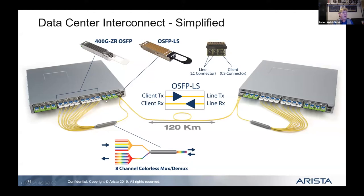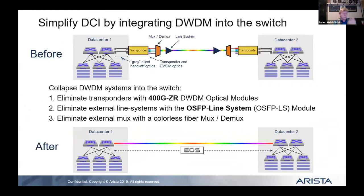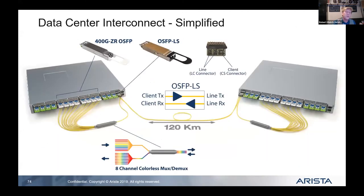Think about it: four times eight equals 32 — that's 3.2 terabits that can go across a single pair of fiber long haul. So if you have a multi-site facility needing redundancy and high bandwidth, the new transceivers give you that. It's essentially just a mux — bandwidth is no longer the bottleneck. This is taking what 400-gig allows to the next level.